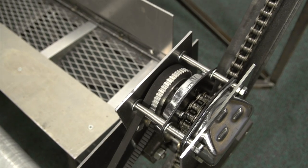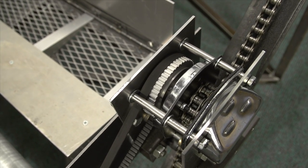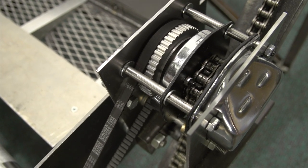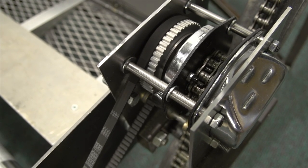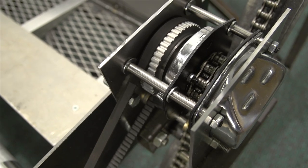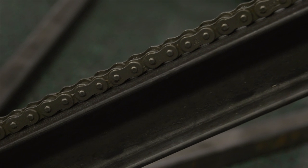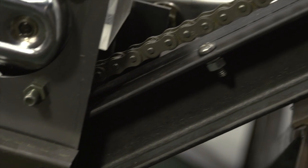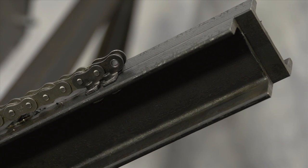We started by purchasing a quarter-ton garage style hoist. In order to increase the reliability and aesthetics and decrease the cost and size, we decided to switch the chain link gears to a belt gear input and a roller chain gear output. A detailed analysis was performed to find the optimal gear sizes for both belt gears and the roller chain gear. The funicular uses a roller chain in a rack and pinion fashion for power transmission. The chain acts as the rack and is bolted securely to each end of the rail. Safety was a major concern for these attachments, so stress analysis was performed to ensure safety under the highest expected loads.